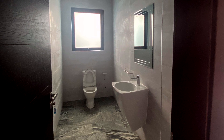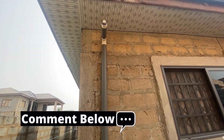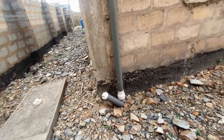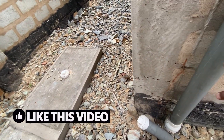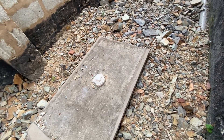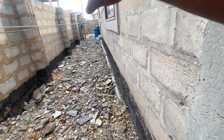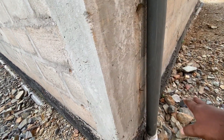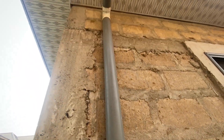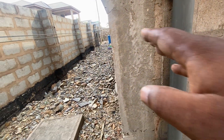So the next time you do a biodigester, do not put a vent pipe on it. This here is a typical vent pipe. Ideally, the vent should be on the building. You can have an inspection chamber for the digester so you can open it up and look inside if needed, but have your vent routed neatly along the wall — it can be a two-inch or three-inch pipe — and let it run all the way to the top.